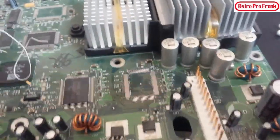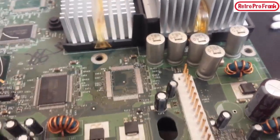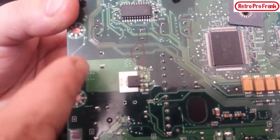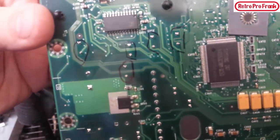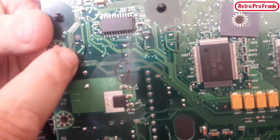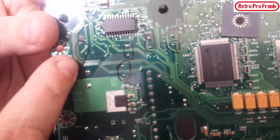If I really wanted to be cheap I could have bought them on eBay — a bag of 20 of these for like two bucks. I looked at the capacitors on the other side, flipped it over to find the leads. I usually circle them with a black Sharpie just to see where they are. These are the connections we have to heat up with the soldering iron — we're going to wiggle them out from side to side as we pull them out.